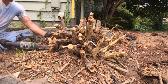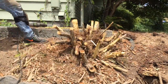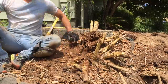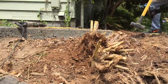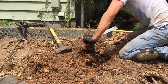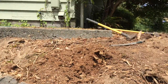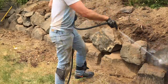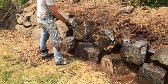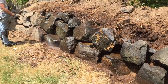This massive behemoth can't be removed with my farm jack or my truck, so I resort to brute force with a sledgehammer, an axe, and of course my trusty reciprocating saw. I'm quite happy I was able to remove this stump the way I did — the only other option would have been digging it out completely, which was the last thing I wanted with this root system. After all stumps are completely removed and the rocks looking pretty good, I hose off all the rocks to give them a good final cleaning before applying the concrete I'll be mixing up shortly.